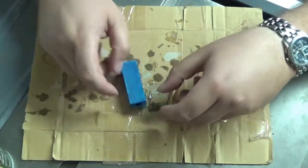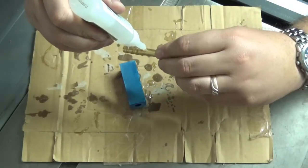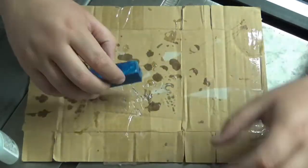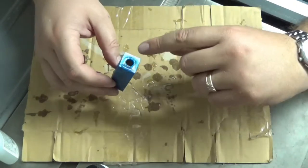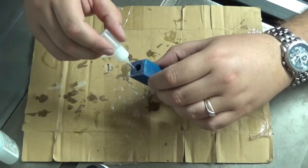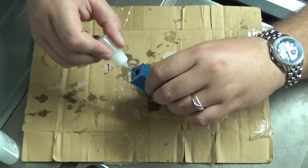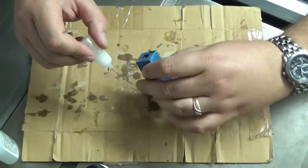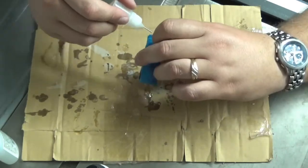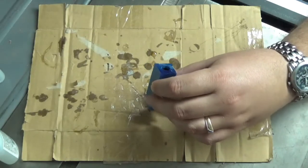Kind of fun. So let's get this glued in. We've got a pre-roughened barrel, so this is gonna be really easy. So we've got that cap all sealed off, so now we can go to our backside and fill this in with a little thin CA. And there we go. Hit that with a little activator. And that'll be ready to turn by morning.